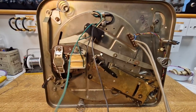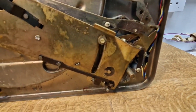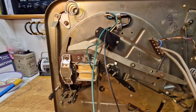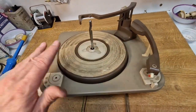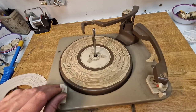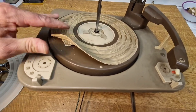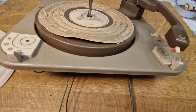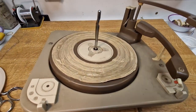This is the underside of the deck. They're not as complicated as some of the earlier decks — this is just going to be a matter of having a really good cleanup, de-greasing the old hard grease. You can see this one's all gone hard — we'll take all that off. I think this is a UA14. This old rubber mat, as you can see, is crunchy and horrible and starting to fall apart. But thankfully there are people remaking them now — I've got a lovely new cream one that will go on there when it's finished.